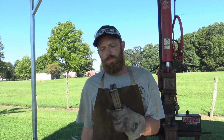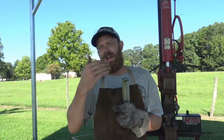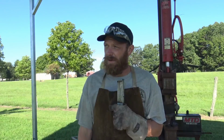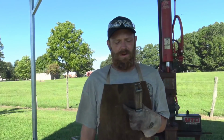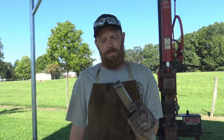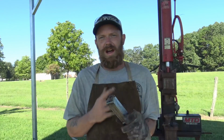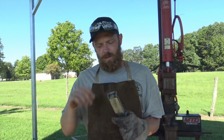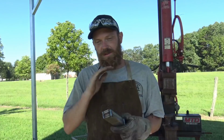I want a low layer count twist, and then once we cut it and stack it, I guess it can be considered 18 times 4 or 5, however many times we stack it. But I don't really know how to judge a twisted layer count. But I know we're starting with 9. I'm gonna cut and fold it 1 time, and then we'll draw it out and start twisting it, flatten it out, cut it up, stack it up.